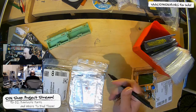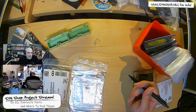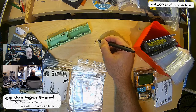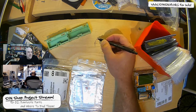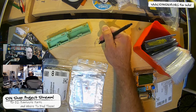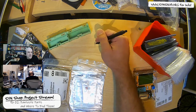A lot of the knobs are actually screwed in place, like there's a threaded insert. But if that nut rattles off because you're sitting in front of a bass speaker stack or something, that's added flex. Well, not only that, but the front panel will flex a little bit. Granted, you've got all the other knobs that are helping to support it, but that's still a relatively weaker design.